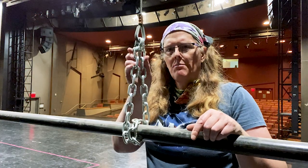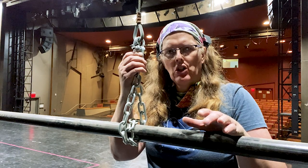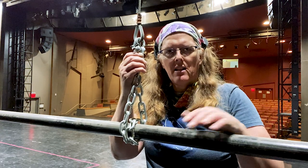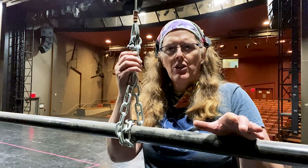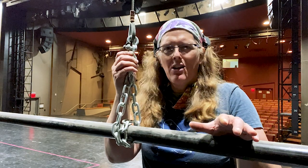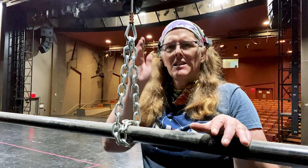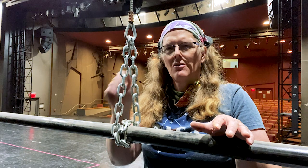This shackle is moused, but only with a zip tie. For any long-term mousing, I would never use zip ties because they get brittle and fall out. So if you're doing a long-term installation like most of your line set rigging, you want to mouse it with mousing wire. If you're doing a two-week or several-week show run, zip ties are fine — they're faster, easier, and you can just cut and snip when you strike. But for anything that's a permanent installation that's going to be there for several years or longer, use wire mousing.